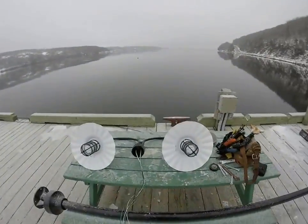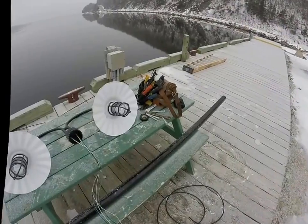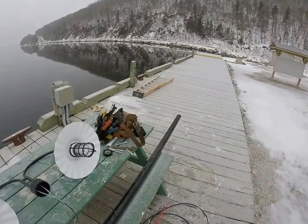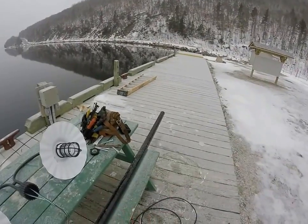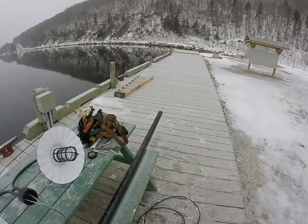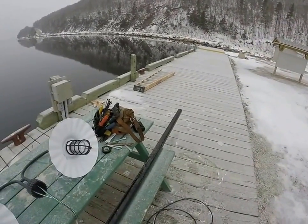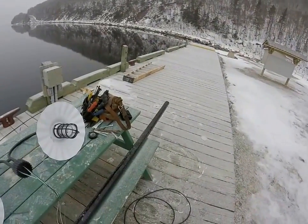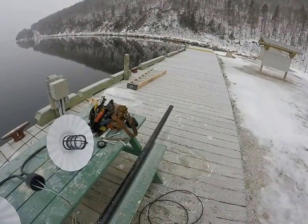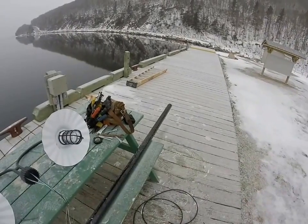I have a piece of cable here. I already have stripped. This is a cold rated, so I'm not gonna use the red. Cut that right out. Whatever wire you use should be rated for the cold, because in the wind and stuff these poles are gonna move a little and the wires will bang around inside the poles and eventually they'll get brittle.